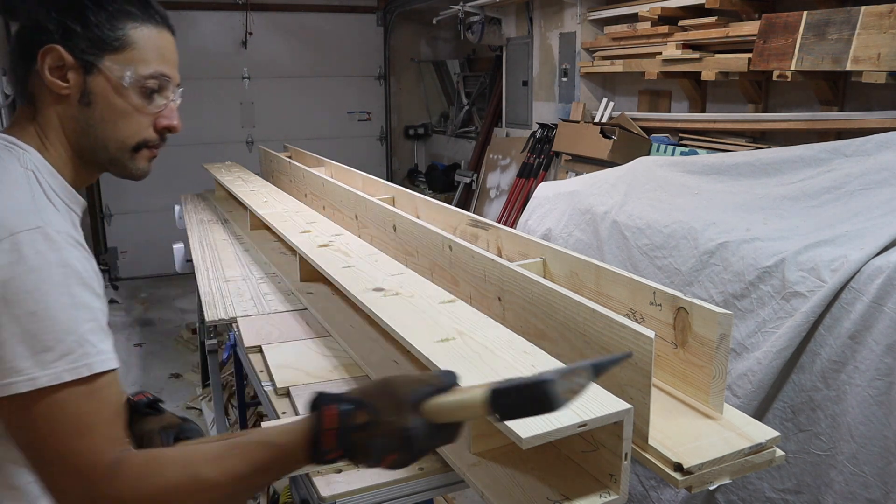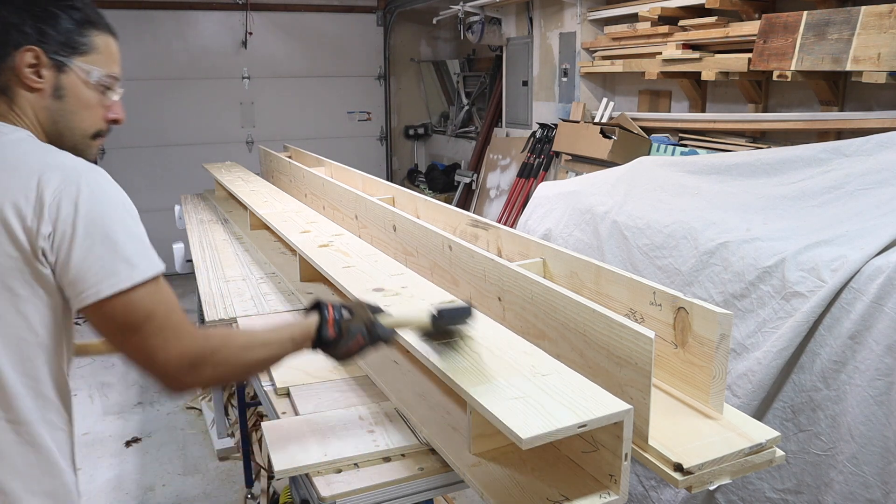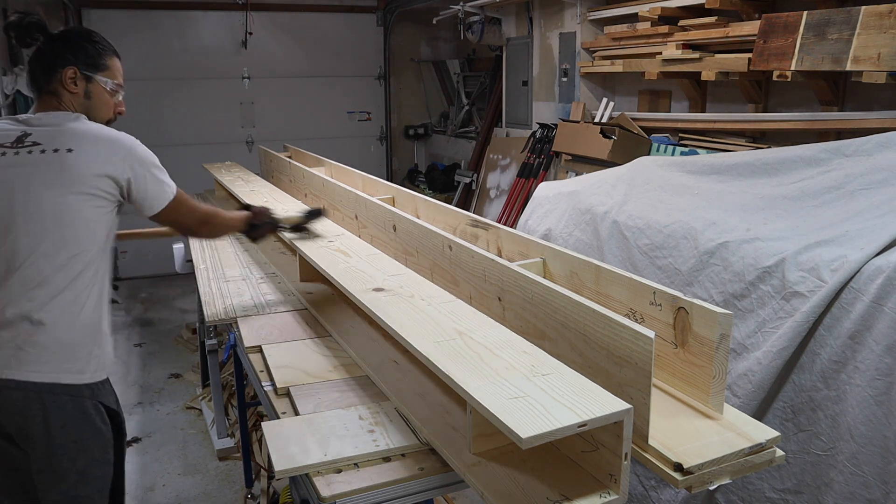When you come to the end of the board and you finish hitting it with the axe, take the axe and just scrape it along those strokes that you just dug into the wood and remove and clear out any of those chips that will be sticking up.